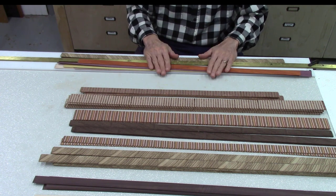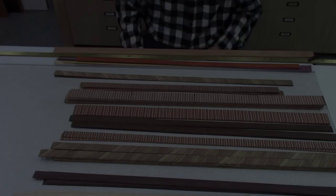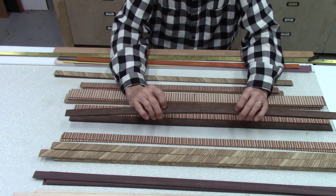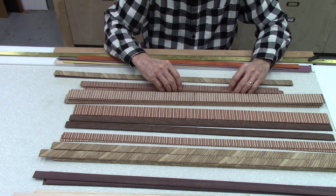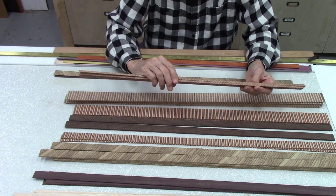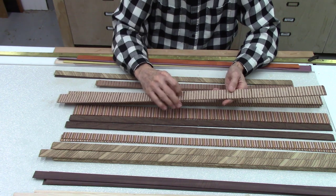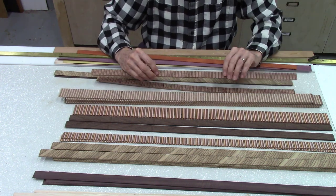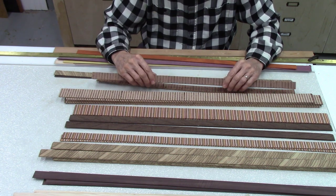This again is two layers of the zebra wood with a piece of maple glued in the middle. On the outside I'll be putting two more layers of maple and red heart, creating a seven-layer inlay strip. These thin pieces work better using the small glue jig — I can just add glue to the various layers, put them in the jig, and clamp them down to create the needed pattern. Most of the inlays I'm doing will be these thin strips which are about a little under an inch wide, but I also made some wider strips.